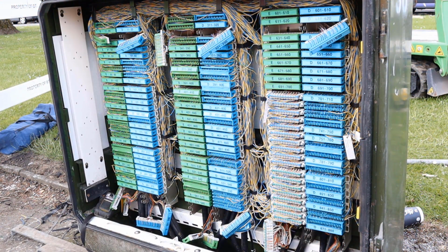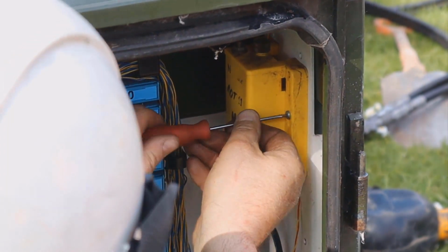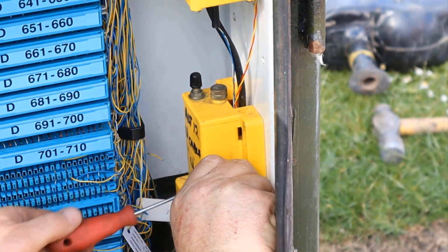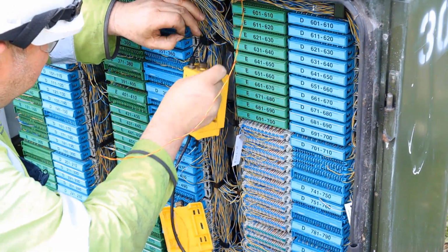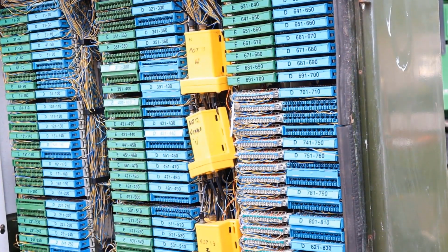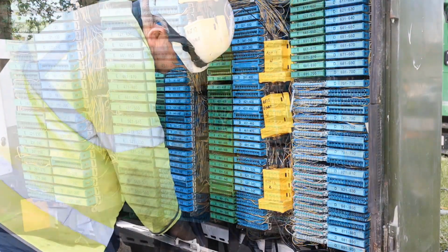With all the screws released, the modules must be reinserted into the back mounts before any lifting can commence. At this point, carefully release the transducers or pressure gauges and securely attach them to the modules. With everything now back in place and the transducers secured, lifting and release of the back mounts can now commence.